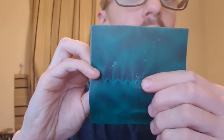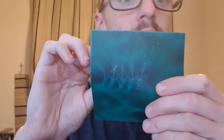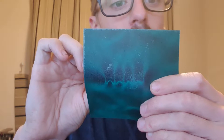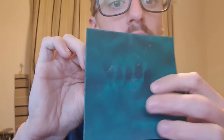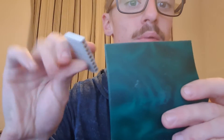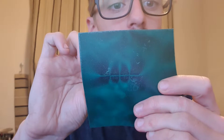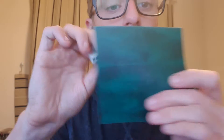I've got some magnetic viewing film, so you should be able to see. You can see the top side of the array is significantly stronger — it's generating a stronger field and reaching out further than the bottom side of the array. If I flip it... versus a standard array, where both sides of the array have equal field.